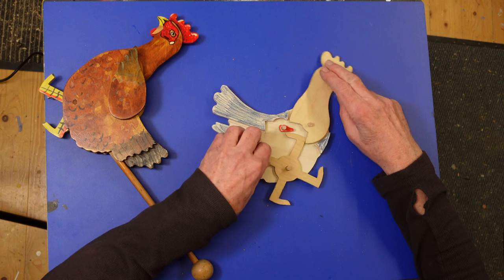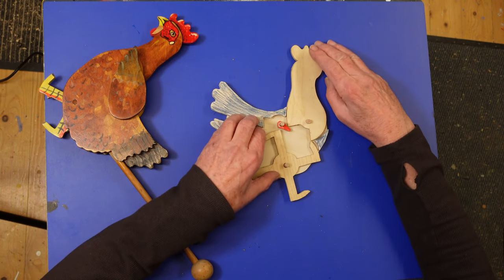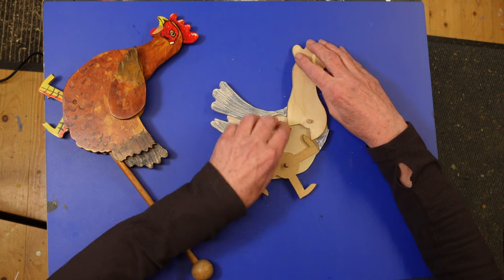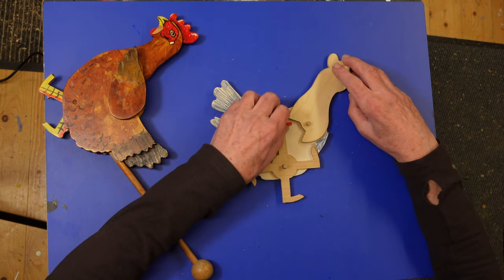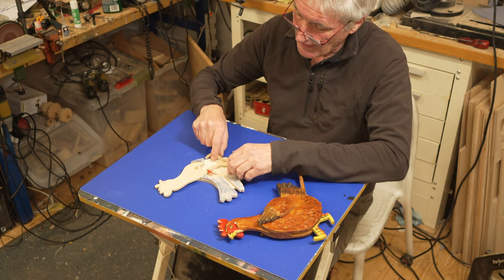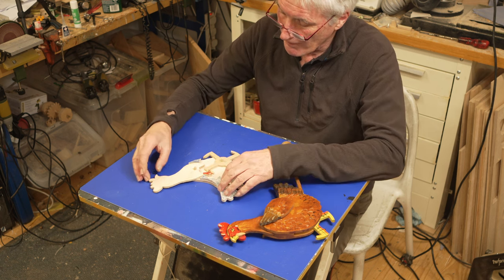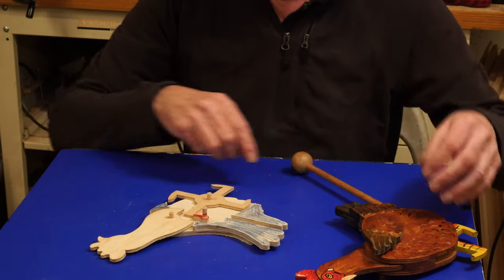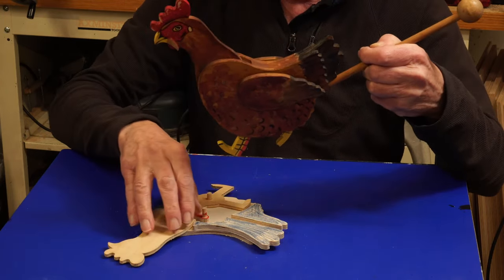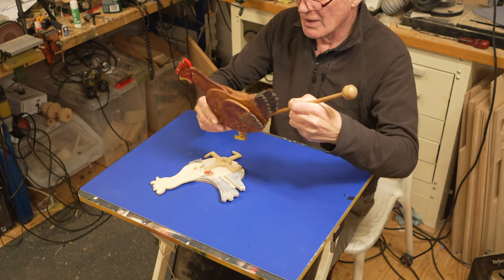Now what happens is: it pushes down there, you see, so it lifts the wing up. And then once the leg goes round a bit, the wing pulls that back down, and you're ready for the next one. It goes down and that's going to have been pulled back by the wing. You need to make sure this is the right size so it clears here and doesn't go so high that it just pins against it. It needs to stop so that when the head comes back it's able to push it — a little bit of experimenting might be required. As you can see the action: when the head goes up, it pushes that pin down and the wings go up; head back, wings up, and then it reverts until the next cycle.